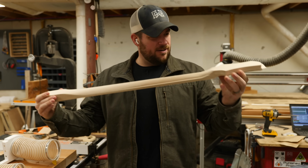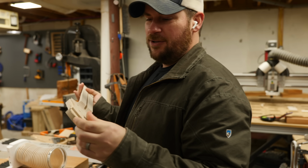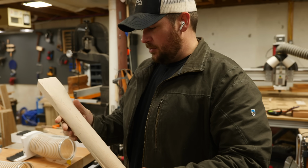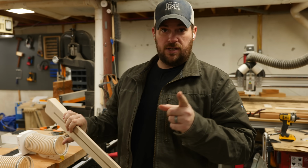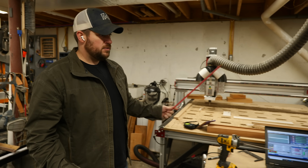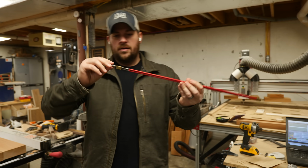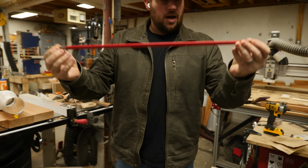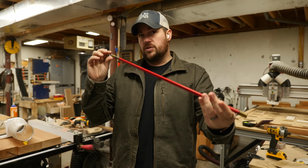So the material held here and held there, but I didn't do this right, but I was rewarded by it not being ruined. So I'm going to take some sandpaper to this, and I'm going to smooth it out. But the truss rod just came in. Let's see if it actually fits. So this is the rod that you would put an Allen key in here and you would turn it, and the top one would tighten and it would force this to bow opposite the string tension.